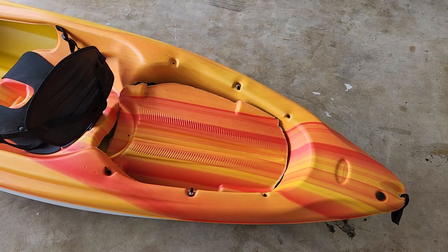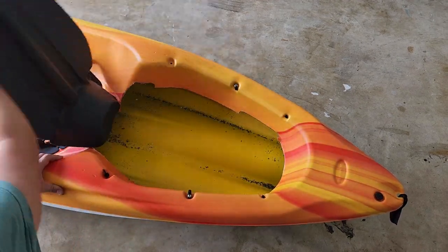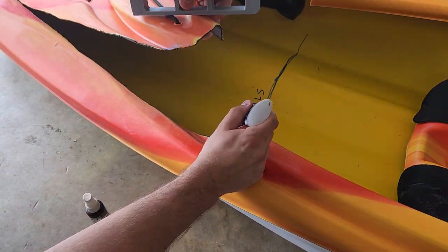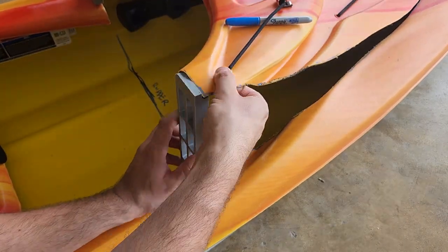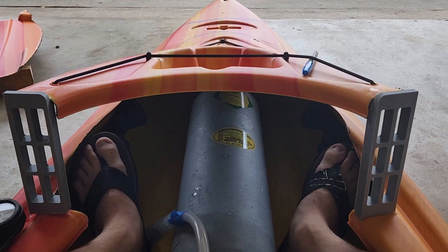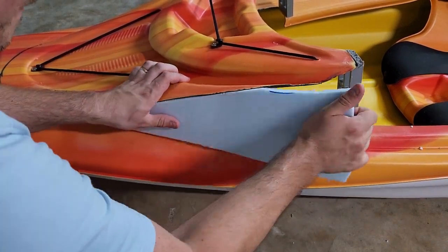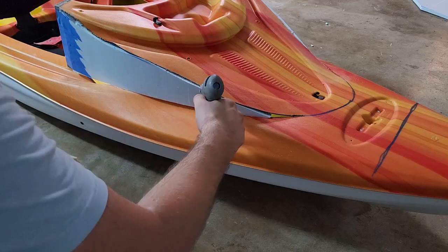Back to the modifications. The next thing I did was remove this panel on the backside — this is where I'll put my battery and other electronics. Next, I 3D printed these spacers as a sort of scaffolding to hold up the flap on the front end while the side walls get fiberglassed on. This should be enough space to fit the air tank and rudder pedals without a problem. Once the caps on the side are fiberglassed over, the air tank will be strapped to the top wall and the rudder pedals will be directly under it. To give the fiberglass a solid scaffolding to rest on while the epoxy resin dries, I cut two foam panels to fit the gaps and hot glued them in place.